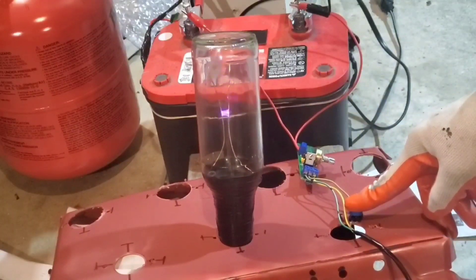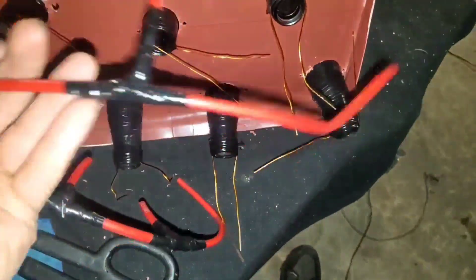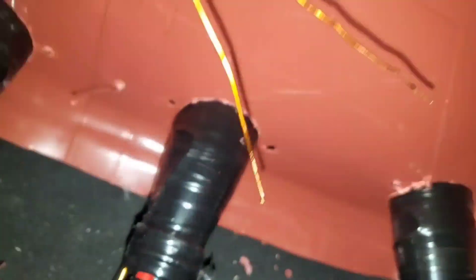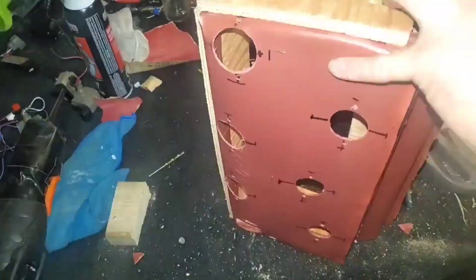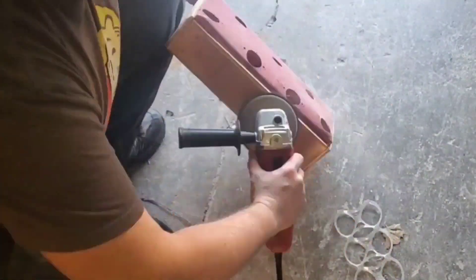I've got a big helium tank on the left. I inject helium into the bottles while playing using a manifold I built, which lets different gases into the bottles to change the color of the arc and the electrical resistance of the air — so I can get different sounds as well as different colors. That's something I'll fine-tune in a future video.